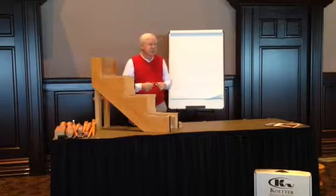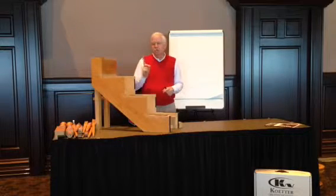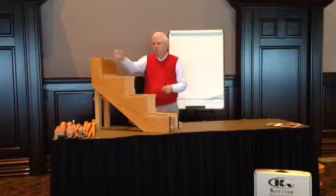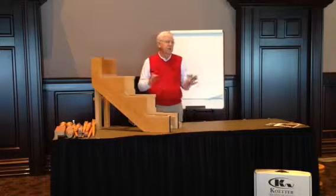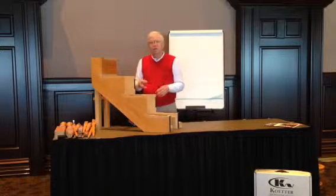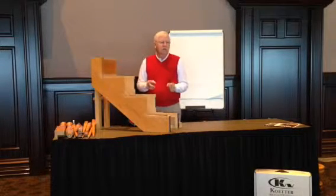We're going to do a short exercise in how to actually do a stair takeoff in 30 seconds with only one dimension in mind. Stairwork is relatively simple if you can unclutter your mind and not look at the fact that this is a long triangle with all these cuts, a handrail, and fittings. In truth, you're looking at nothing more than a triangle, and if you can understand that triangle without the math, you can do a stair layout and the majority of a takeoff by knowing nothing more than one dimension.